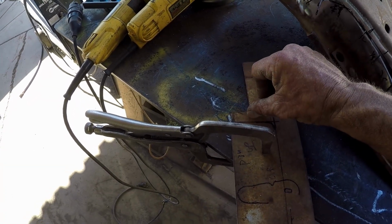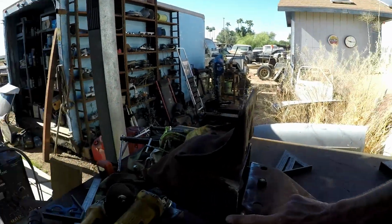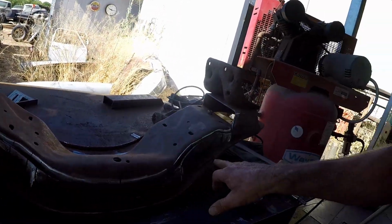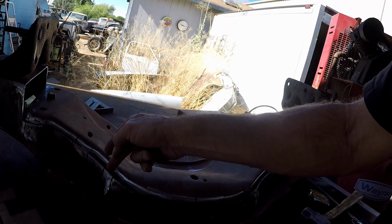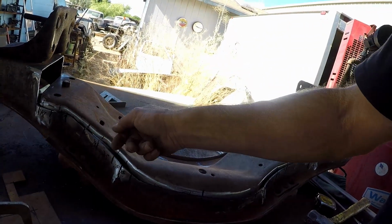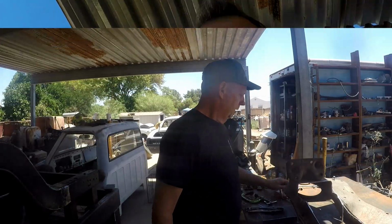This is the back part, front part, and theoretically you can take your measurements out here and then subtract 1/8 of an inch all the way around, which is usually a pretty good starting point. So we'll go ahead and cut this out, we'll bang these around. I kind of split the difference as to where they need to go, that way we can do these relief cuts and start coming back towards it, so you don't have some weird kind of step or something like that going on.